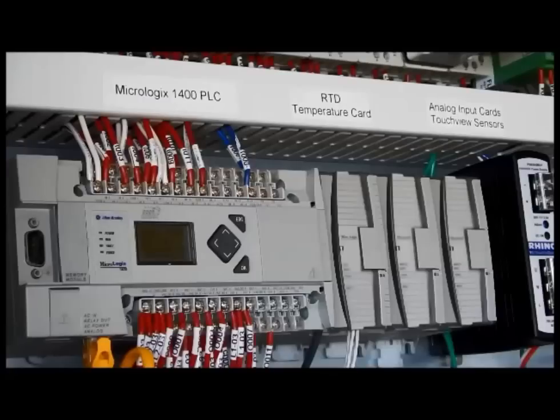Next to that, we have blue wires, and this is where the analog inputs on the brick itself begin. The blue wires are related to voltage, and it receives an analog signal from a voltage transducer that tells us what the actual voltage is at the moment. Inputs next to that with no wire in them at the moment will relate to motors in the air conditioning unit, informing us of how many amps the evaporator motor, blower, or condenser fan motors are pulling.